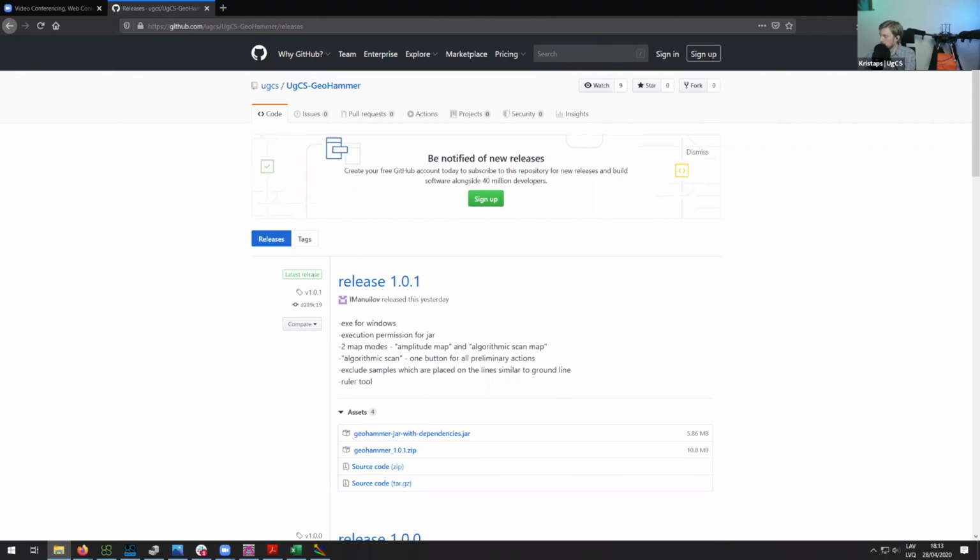Yeah, so I see another question from Andrea. Yes, when you're using a GPR on a drone, it does lose a bit in the penetration depth. This is also because of how the beam travels through the air. So it does get a bit dissipated, so to say, and the higher you go, the less you will see from the data. So for example, if you would be flying at 10 meters with the Zond radar, you probably wouldn't really be able to see anything. So you always want to be as close to the ground as you can.